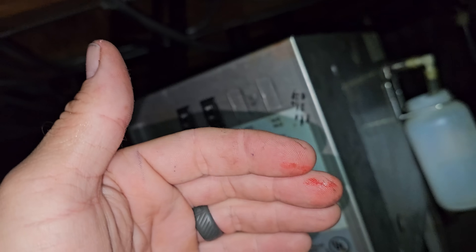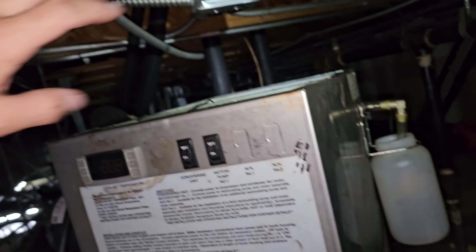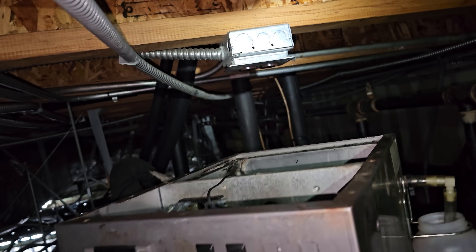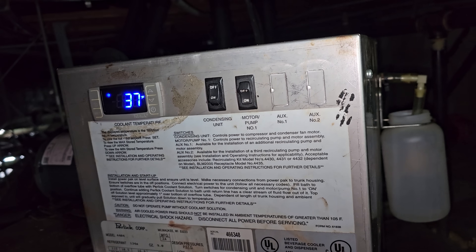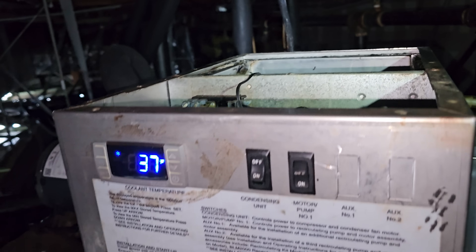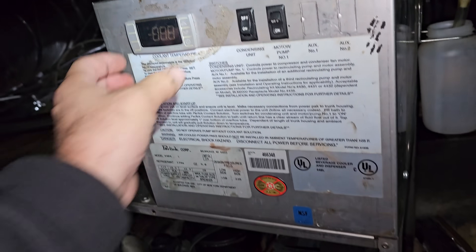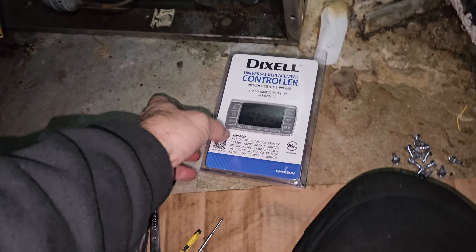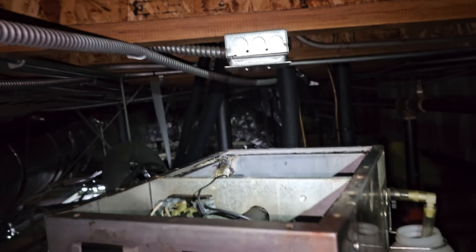This is a tight space — I whacked my head hard. Luckily I just got a tetanus shot because I hit my head in another attic and got a nail through it. I've got the sensor ran over — I'm going to put the screws back in and plug it back in. It may be the control that's bad because it's back and running — let's see if that temp goes up. It should be much higher than 37 degrees right now because it's 55 in that glycol reservoir.